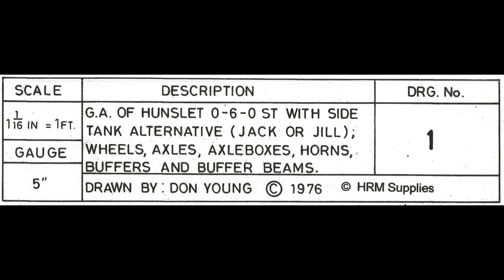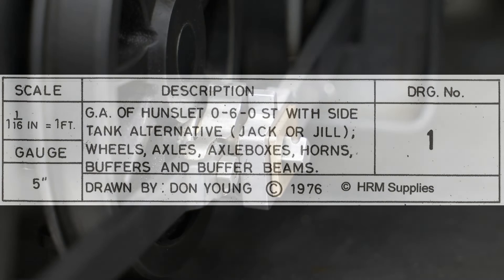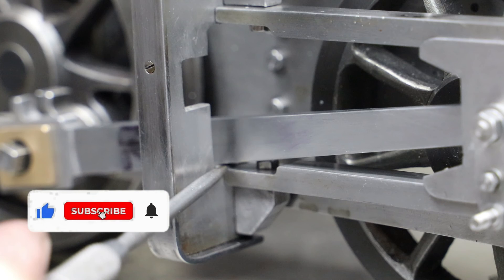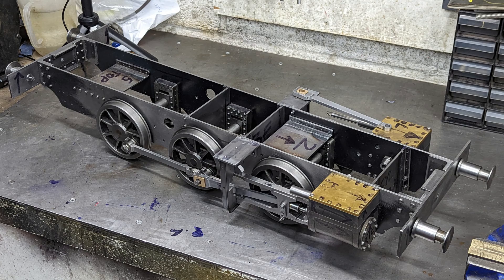So where does all this leave me? Firstly, finding these sorts of issues is not unexpected. Don's designs were penned way before CAD and 3D modelling, and I don't believe this particular engine ever went through serialisation in one of the magazines, which often flushed out design issues. So I need to do some thinking on how best to address these issues. For the crankpins I've already identified a fix, but I'm going to give it some more thought, because if I can avoid having to remake those crankpins, that would be superb. The gap between the coupling rods and the connecting rods I can live with for now. For the conrods fouling with the slide bars and combination plate, I think I've got a way forward, but I do need to think about it some more and draw up the corresponding design, and I'll probably get on with that next. I'll finish off this video on a more positive note, with a couple of views of the engine as it's coming together. Thanks for watchin'.